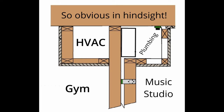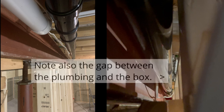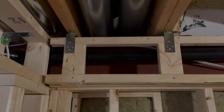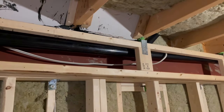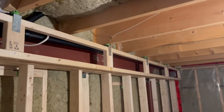It's a great example of the blind spots we can develop when doing a DIY project. Before building the box around the plumbing I wanted to bring it in tighter against the wall, as it was going to stick out quite a bit and get in the way of my plans for acoustic treatment along that wall. My father-in-law was very generous and helped me — he tucked the plumbing tight against the wall and then we were able to build a slim 2x2 stud frame for that box. I wanted the box to stick out no more than 6 inches from the wall, and in the end it only sticks out 4.5 inches.